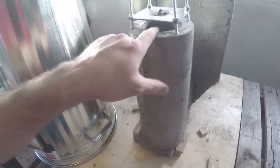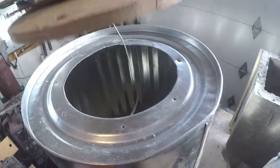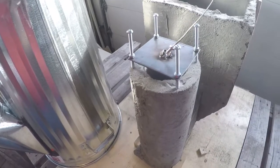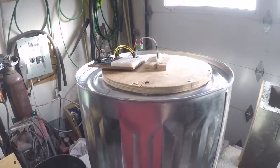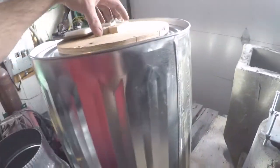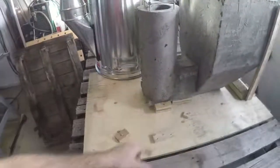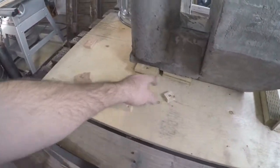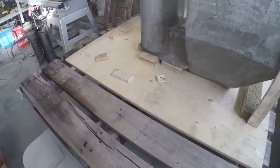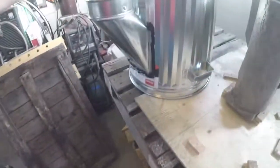This results in the same area as the entire assembly. Over here you can see the Arduino, and I've got a big gasket to go on top of the can, and the probe — the probe just threads into that hole and it touches the top of the plate. The Arduino hooks up to my laptop and when I turn on the polling it'll gather data every five seconds, transmitting the temperature. There's a gasket on the bottom of this — it gets sealed on, the whole can goes over top, and there's an opening cut right here that slips over top of these guides. This one actually turns to lock the lip down.